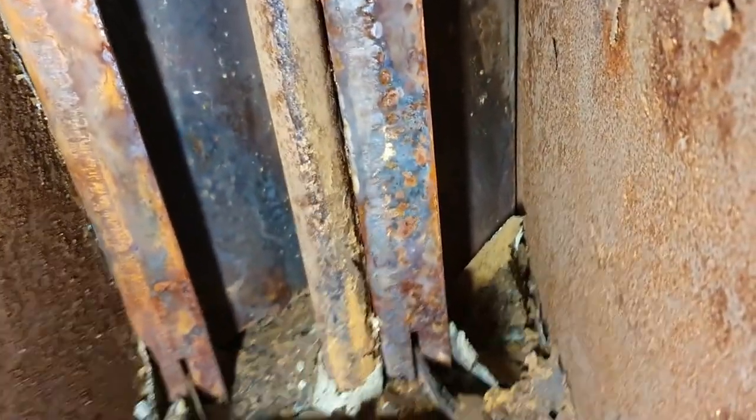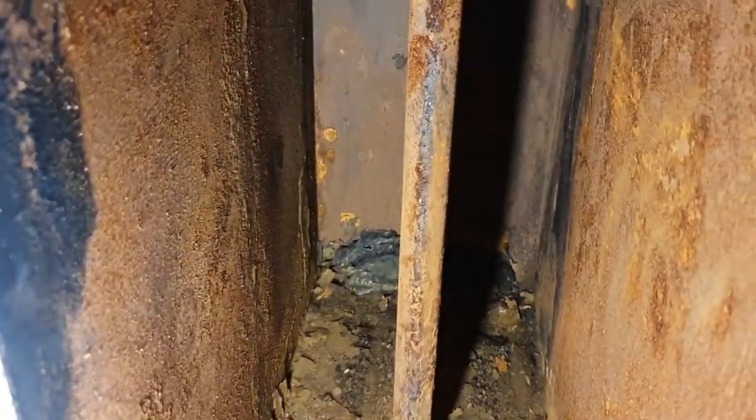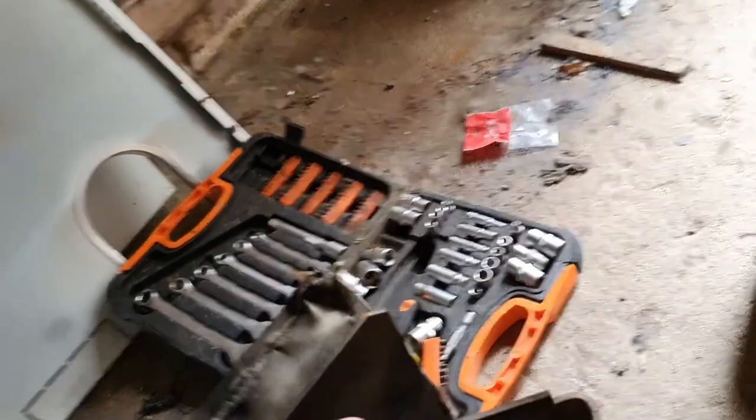When the oil is sooty you wouldn't want to do this without marigold gloves on because it is horrendous. This one will clean out quite nicely. All these baffles need to do is deflect the heat onto the side of the box because you've got waterways in here. These don't look too bad at all. They're labeled top and bottom but you always want to take your baffles out in the order they come out - don't get your baffles mixed up because on some boilers they can be a nightmare. Stand them in the order they come out so you never get them confused.